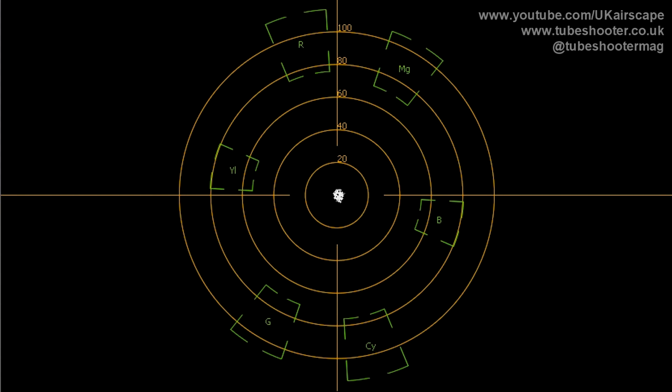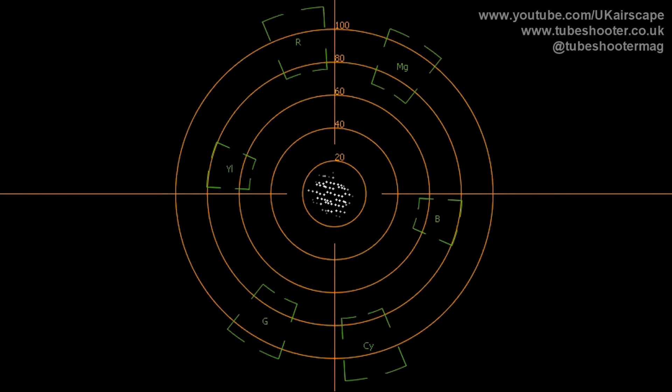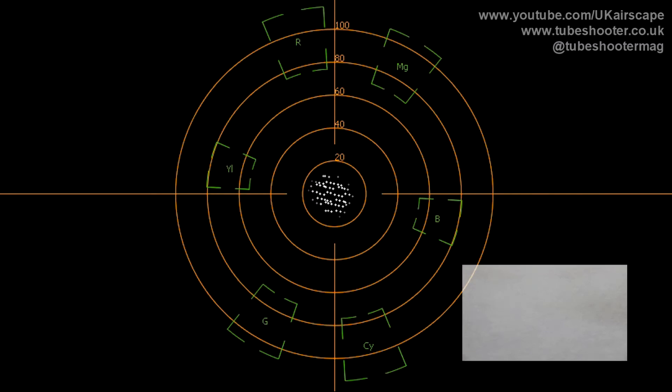For a more technical analysis of the colour spectrum, here's the vectorscope reading from when the camera was pointing at the white wall — pretty much exactly what you'd expect, with all colours equally represented, giving a single compact dot in the centre of the screen. To examine it more closely, I increased the saturation by 300% and varied the light intensity. At 100% there is a very very slight bias toward the yellow side, and as the light dims it shifts very gently back toward blue — but it's only a fractional shift, barely visible at normal saturation. I'm happy with the colour spectrum of this light.